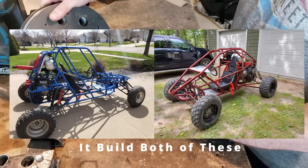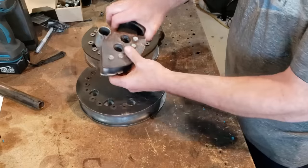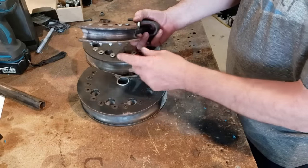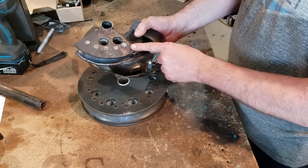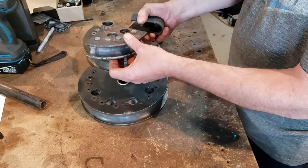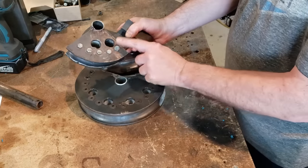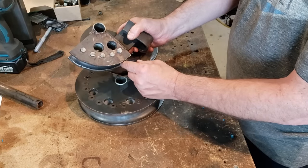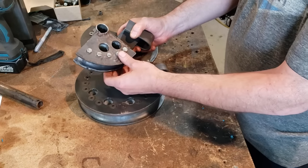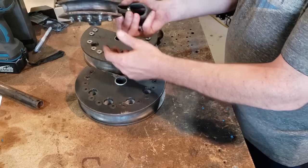That's our inch and a quarter die. The one we're replacing is this inch die — this was one of the first ones we made. We hand cut this one, printed it, and put it together. The reason we're rebuilding it is because we've got an upcoming project where we need to bend 180 degrees with one inch tubing, so that's why we're making the new die today.